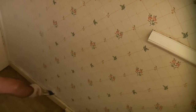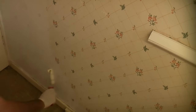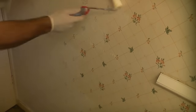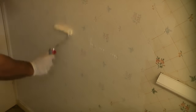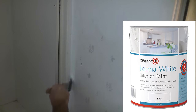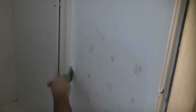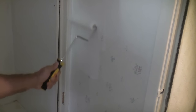I'm now going to speed things up a little to make the video as short as possible. Now the primer has dried, I'm applying two top coats of Zinsser Perma White. This is an ideal paint for use in kitchens and bathrooms as it is mould and mildew resistant. Again I'm using the brush to cut in at the edges, then the 4 inch roller to roll out the brush marks.